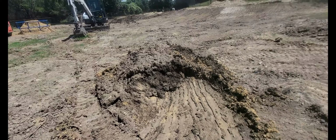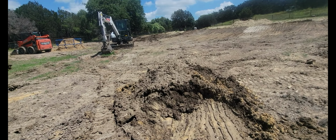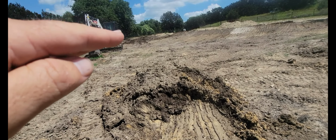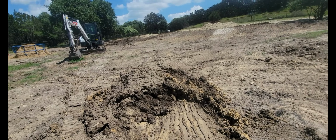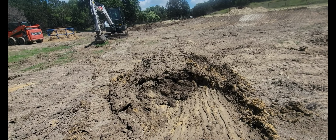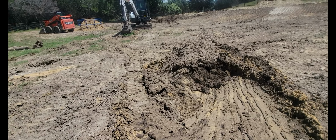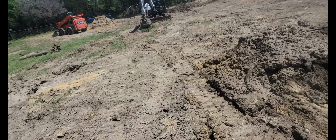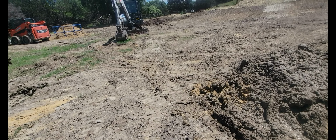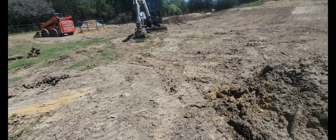And then I probably already told you this, but every day I'm working on that soupy area, and it is getting better each time I go on it. I mean, I'm able to kind of compact it down, and it's compacting so much I'm getting a low spot in the dam, which I'll be adding some more clay to. But that's the area where I was scooping out, making the Big Timmy pond deeper. So the clay I was scooping out of the pond was actually saturated with water, and I was dumping it straight onto the dam, so it was saturated, squishy, all that kind of stuff. So it was kind of leaching out through there. But I think as I'm compressing it, I'm kind of drying it out and stopping the leak, pushing the air out of it, I guess. Anyway, let me keep going.